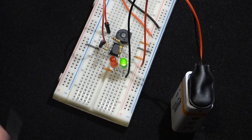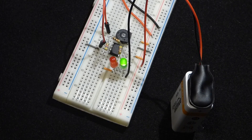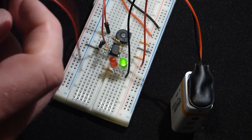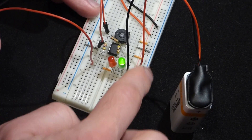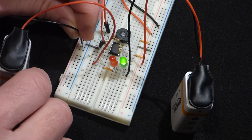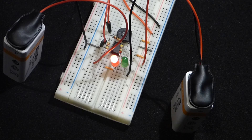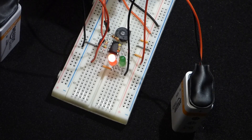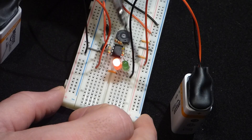When inserting the batteries, one goes in before the other, so one LED may come on temporarily — that's not hurting anything. The first battery has its negative to ground and positive to the positive rail. The second battery has its positive to ground and its negative side going to the negative rail. Once both batteries are in, you can see the LED switches — it didn't damage anything; the circuit just wasn't complete until both batteries were connected.